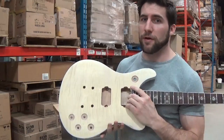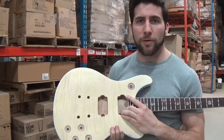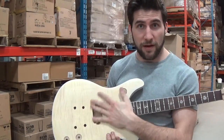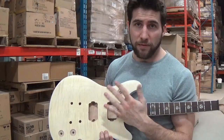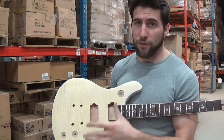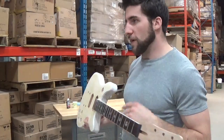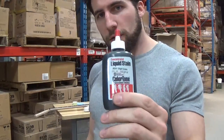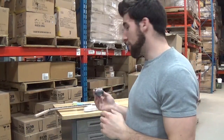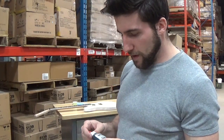What I'm going to do is mix a thin water-based green and stain it with that. Like I said, I'd rather do it with an accent color, sand it back and then go over it again, but I don't really have that option. So I've got this ColorTone bright green here. You can mix it with lacquer, which I will probably do later. You can also mix it with water, which is what I'm going to do right now to create my wipe-on stain.